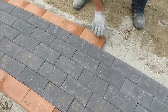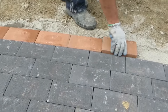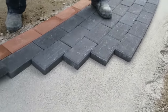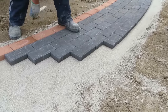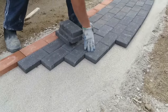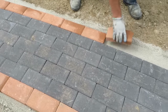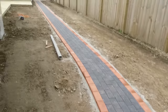Step 6. With a stiff broom, thoroughly brush premier sweeping grout over the pavers to fill the joints before compacting. For small areas, use a rubber mallet to compact; for larger areas, use a plate compactor. Carpet may be required when compacting these pavers to help prevent them from cracking. Keep sweeping premier sweeping grout in until all joints are topped up. Sweep in thoroughly to avoid staining during spraying, then spray a fine mist of water over the area to help set the grout. It is important that you use only a small amount of water.